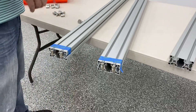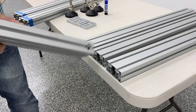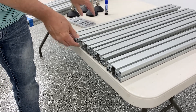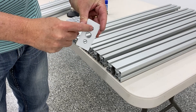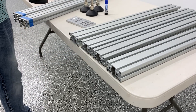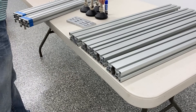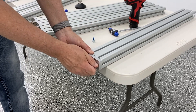Here I am putting the T-nuts together and slipping them into the end of the extrusion for the legs and securing them with blue painter's tape. You're going to want to do this because if you don't secure these little T-nuts somehow, they're going to come flying out. So just tape them — you'll make your life easier. The end of these legs is threaded, and that's where the little aluminum plates screw in. Make sure you orient these plates correctly when you screw them into the end of the leg extrusion. Then drive both nuts on the foot assembly all the way down to the bottom as far as they can go. I used blue Loctite on these bolts just because I knew I would never be taking these legs apart.